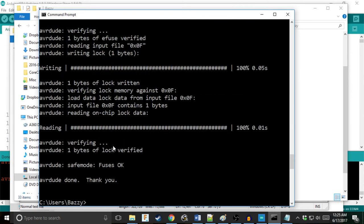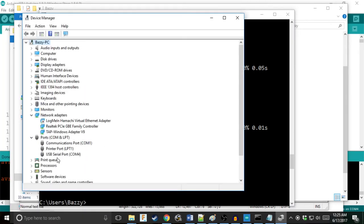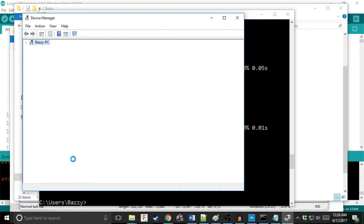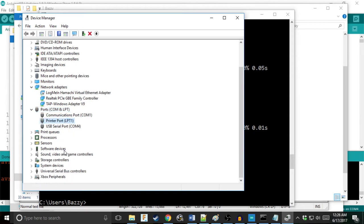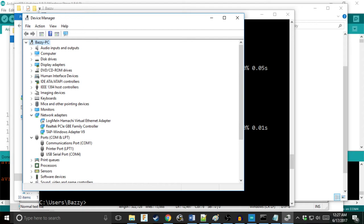The way that you could check this, actually, is because normally when you have an Arduino attached to your computer and you go into your devices, it's right here, under ports, COM and LPT. To know that we did this right, so plug mine in. And see, no Arduino here. Instead, down here, I got Arduino MIDI. Right there. So, we're done. However, we're not done, because we still have to figure out how to upload sketches to this, since we can't do that via USB anymore. So here we go, part two. And by part two, I just mean right now.